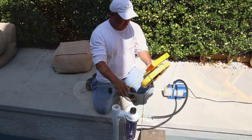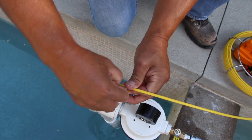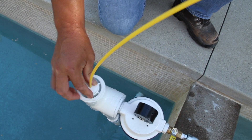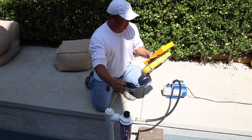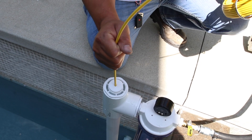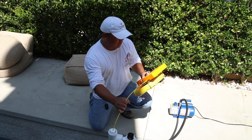We're going to set our camera in as far back as we can. Once we get it in, we put in our stopper, which prevents air from pulling in while you're doing your test. Here we're still going in a little bit, getting past this 90-degree bend right here. Now we're going to do our test.